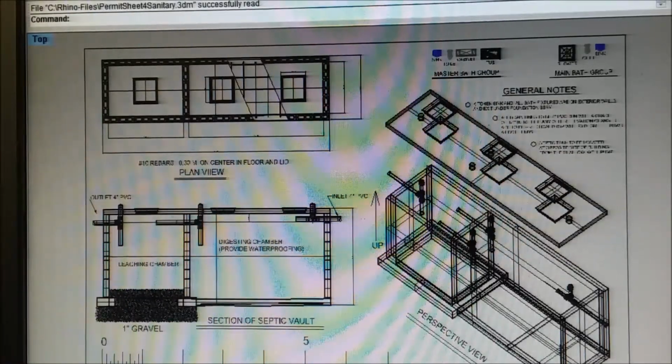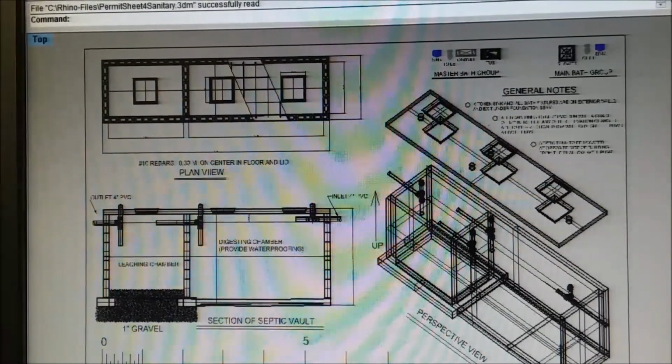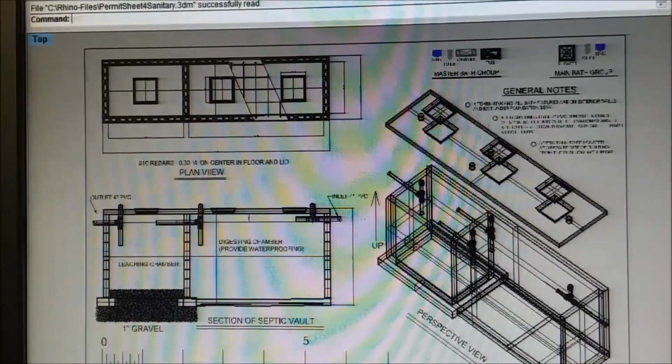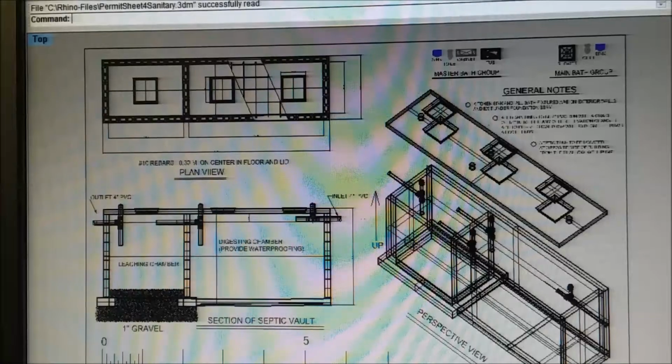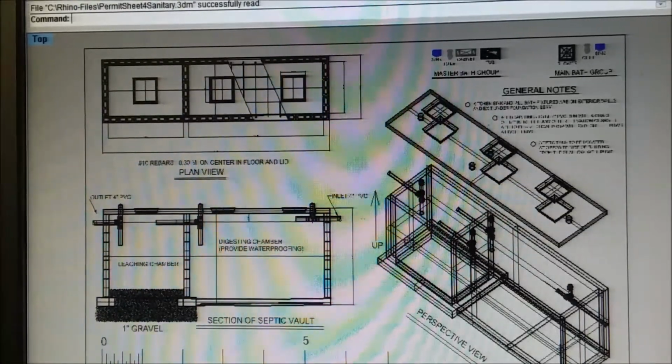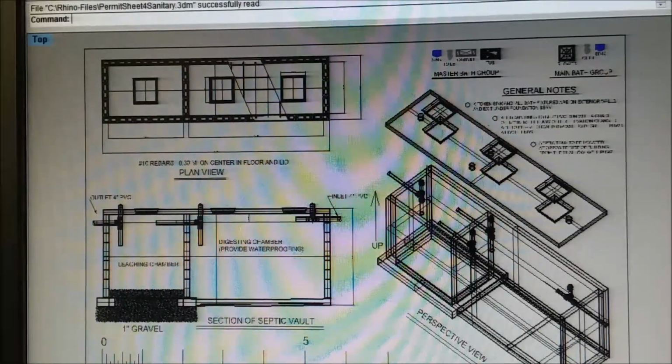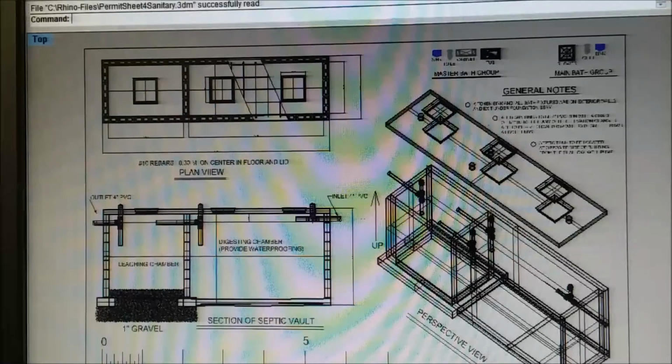So if you just put your pipe from one section to the other, middle of the wall, middle of the water column, then it'll go through that pipe because water's self-leveling. The next one will have the same water level as the first one. So basically, section 1 to section 2 would be, if you were using a 3-section tank, in the middle of the wall. If you're using a 2-section tank like this, what they have got is a standpipe.